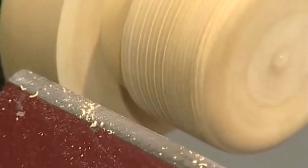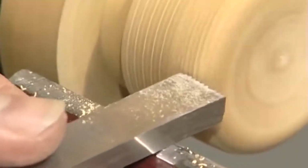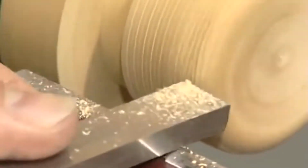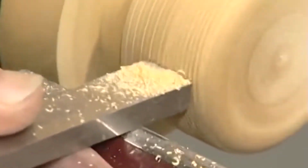The starting point of the thread is on the softly rounded end of the spigot. The cutter is moved around slightly more with each pass onto the flat face. The thread is formed in many passes, each one extending the cut thread by one or two new grooves.